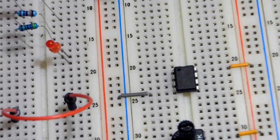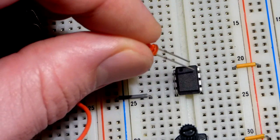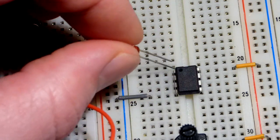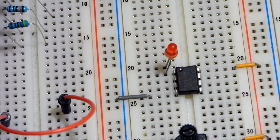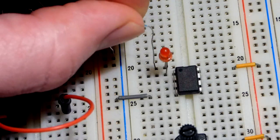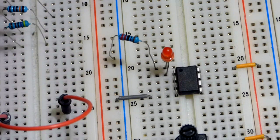When we use an LED as a load, the output is the top pin of one of the op-amps. We'll put the long lead—the anode—to the output, and the short lead—the cathode—we'll go up one row and put a resistor to the negative rail, so the LED will light up when the output is higher than about 1.6 volts.